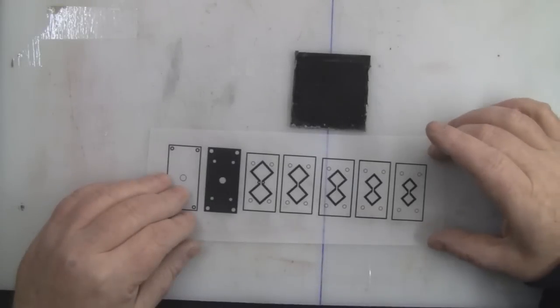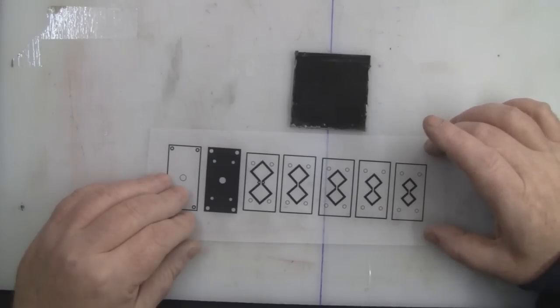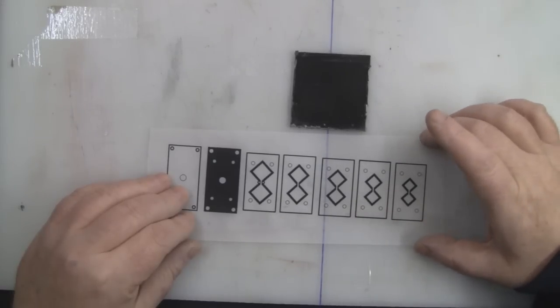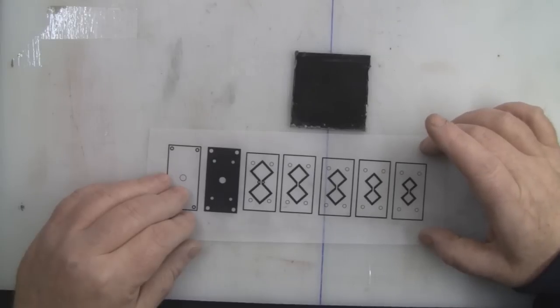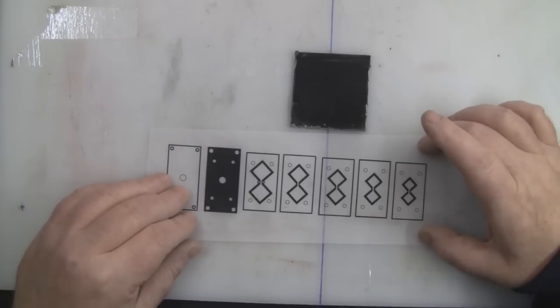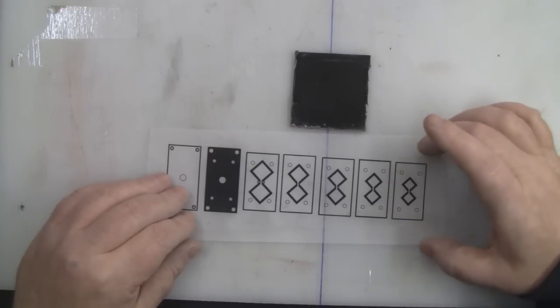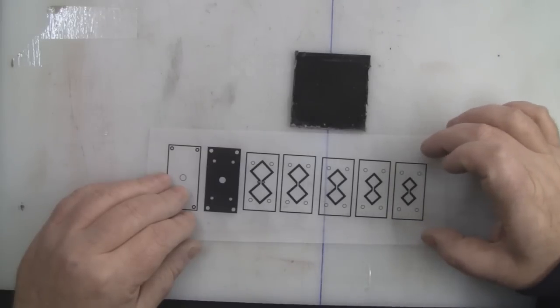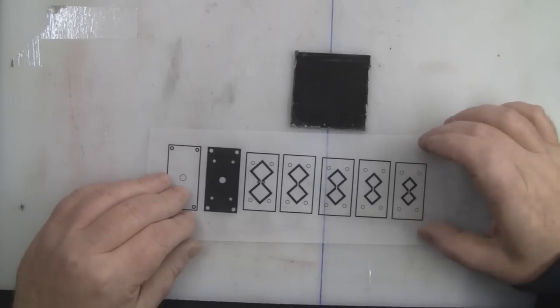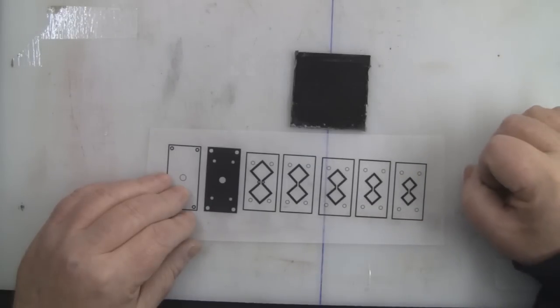So now what you're going to have to do is download the PDF template, and there's a link below for both templates, the 2.4 and the 5.8 gigahertz, in the description below. And you're going to need to print those out using a laser printer. What I've used here is some PCB transfer paper. Now this can be quite expensive, especially if you're not going to do a lot of PCBs at home yourself, but you can also get away with using some overhead projector laser film, printing it out onto there and using it in exactly the same way. That also works really well.